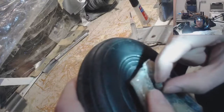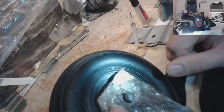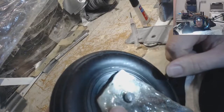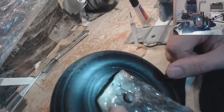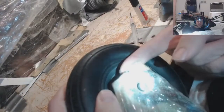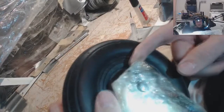So it will be sewn together with 100% nylon upholstery thread, which has about 30 pounds of tensile strength before it snaps. And if we put in like 5 or 6 stitches, that's 30 times 6. That's 180 pounds of tensile strength preventing it from ripping off of this shaft. 180 pounds of force have to be pressed outward like that. That will just not happen. So it will not fail. And that's so much easier than drilling and tapping.